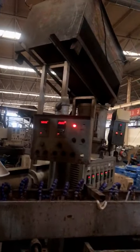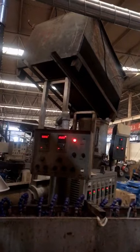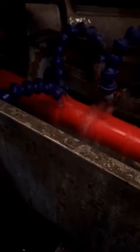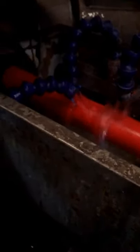And the PVC granules will be made into the outside of the PVC layflat hose. The fiber layer and the PVC layer are combined together after heating, after going out of the extruder. You can see it here. We adopt one step technology. You can see it here, very obviously.